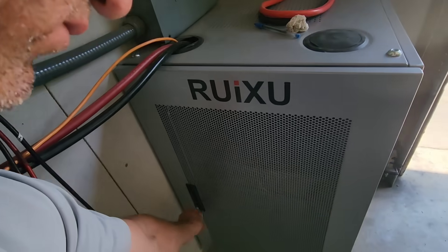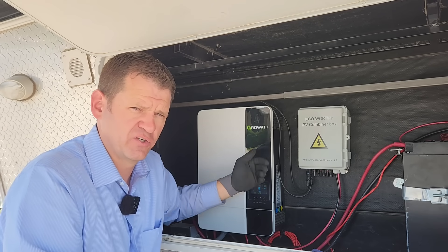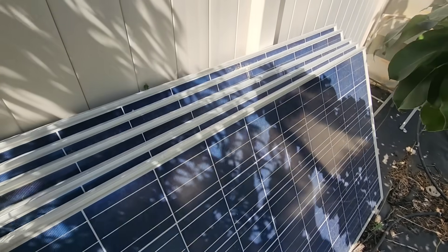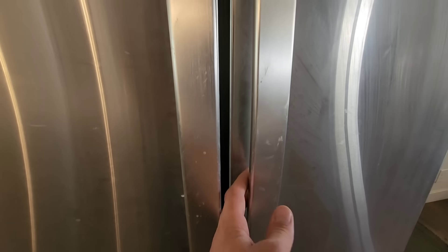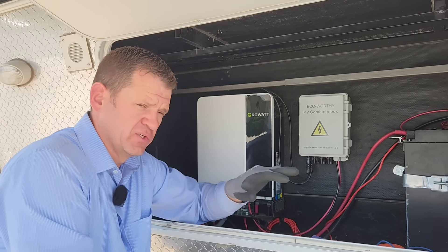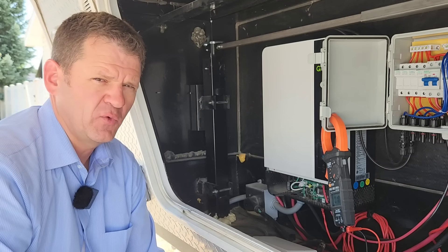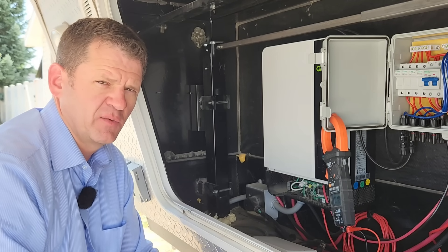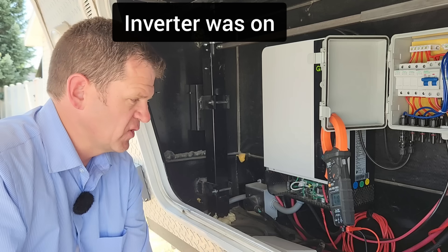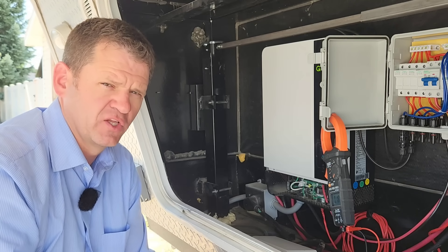It's easy to add more batteries if you want more capacity. You can plug grid in here to charge your battery, connect solar to charge your battery, and obviously you have AC output to power your fridges or whatnot. There is a hidden danger to these units. This system is in my RV right now. One day we pulled up to where we were camping and I realized I wasn't getting any solar to charge my battery, so I figured the PV terminal must have vibrated loose on the long road trip.